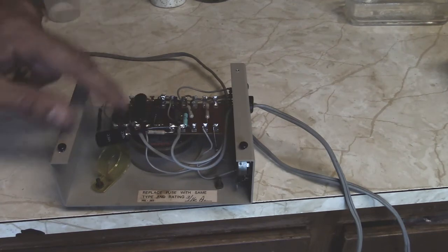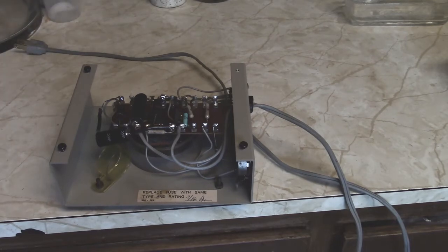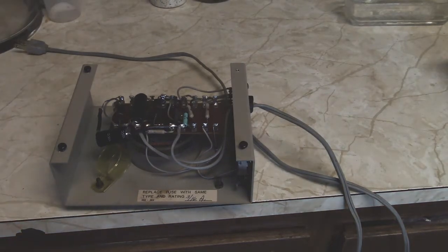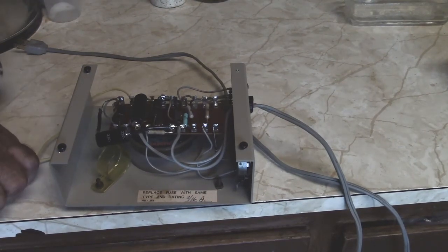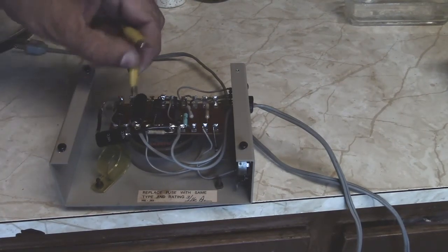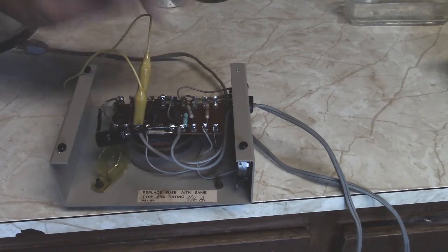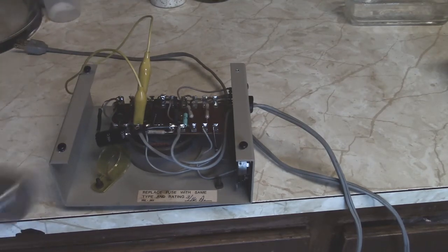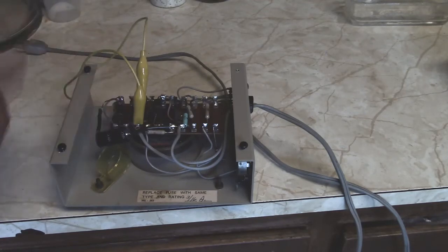Since John's not an electronics whiz, he didn't see this fuse and couldn't explain it to me over the phone. He mentioned a black part — asked if it was a capacitor. Finally he took a picture with his phone and texted it to me, and I said that's a fuse. I asked if he'd tested it — it was open. It's open for a reason, but he jumped around it with a clip lead. It also had a large cap in there that he replaced with a smaller one — a bit of a sketchy job.